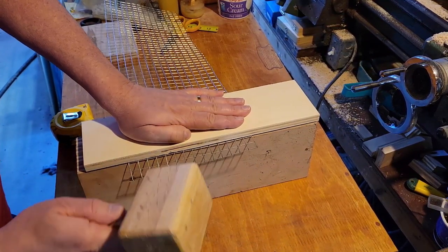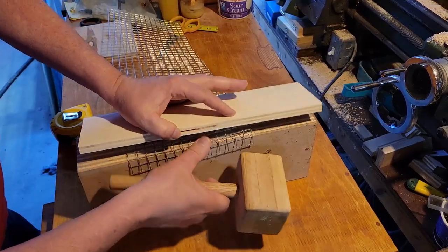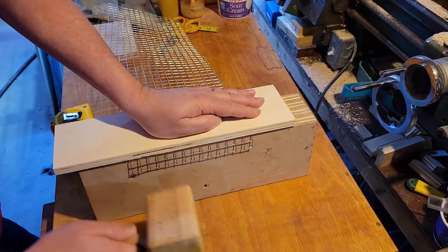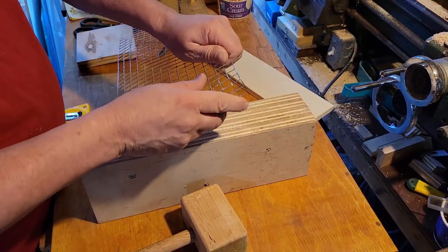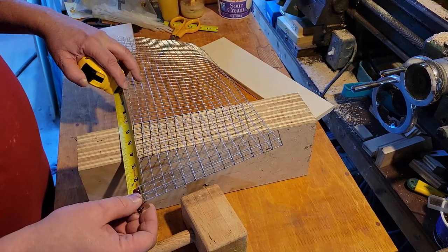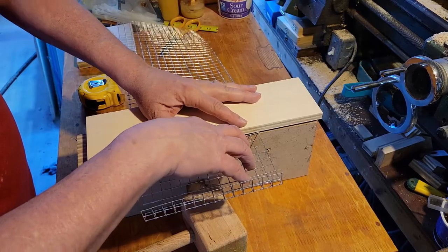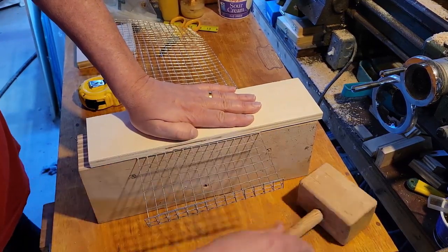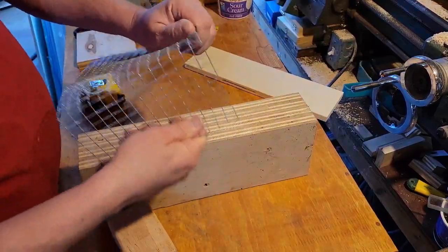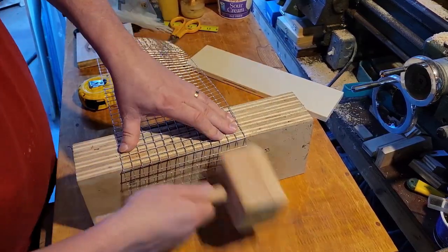When I get there it is a brick wall, so what I'm going to do is drill and use tap cons to anchor this to the wall. It's probably a bit more secure than it needs to be, but I don't want a rat to undo this — there's literally no way they're going to be able to pull it apart because it's going to be securely anchored. All you have to remember when you're doing this is to properly flip it. That part sticking up about an inch is going to be where it attaches to the wall, this is the riser that goes up over the vent, and then it goes along and back down. You just have to remember to flip it properly or you're going to have to bend in the opposite direction.